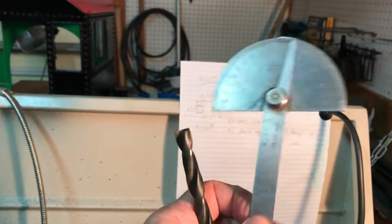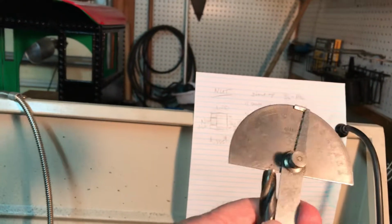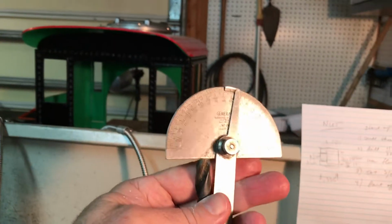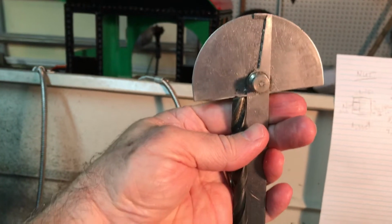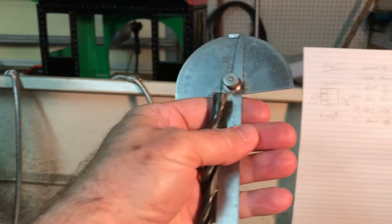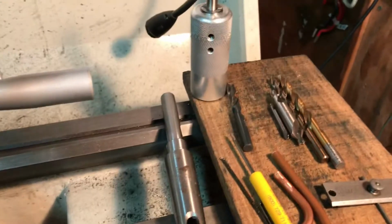And what I do when I'm grinding them, see this handy jig, I'll set this up at, say, 7 degrees minimum. Let's see if I can manipulate that just one-handed here. Maybe if I set it like that. Anyway, you get the idea. When I'm not filming, it's a lot easier. But I can check my relief angle, and I can check it on both sides to make sure it's the same. So check out Tom's Techniques for an actual video about how to grind the relief angle.